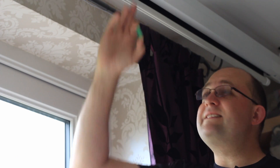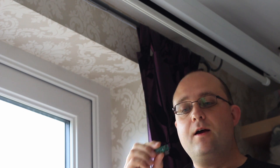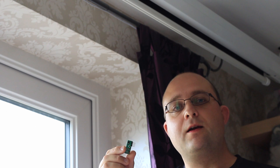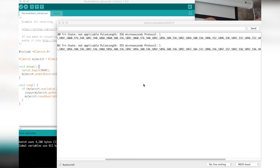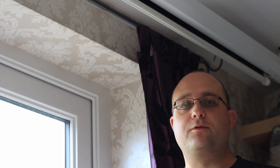You'll find that sockets such as this work out of the box. If they have DIP switches or little dials to select the channel and ID, then they'll just work. For devices such as this projector screen, it gets a little more complicated because there are no standard codes. However, when you buy the 433MHz transmitter chip, you'll typically buy it in a pair alongside a receiver. You can wire this up to the same development board, then press random buttons on your remote control, and it'll listen in and tell you what codes are being transmitted. Then you can modify the code that I'll give you in my tutorial in order to transmit the custom codes that you need to control other devices.